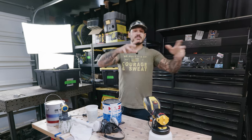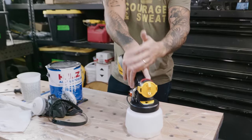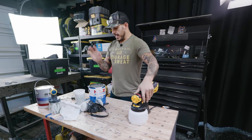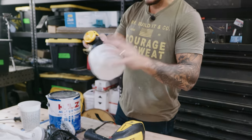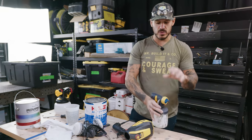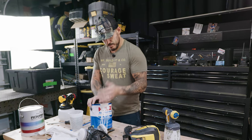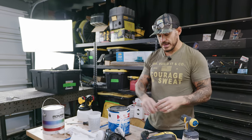Time for paint and primer. The days of rolling or brushing on paint are over - we're gonna shoot it with the Wagner HVLP sprayer. HVLP is high volume, low pressure. This is the Flexio 3500 - it's awesome. It has a detachable canister; you can go big or small. I'm a big fan of the small one - excellent control, minimum overspray, and it works great inside the house. I'll use regular latex primer, diluted by 10% water, pour it in and start shooting.